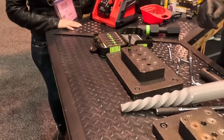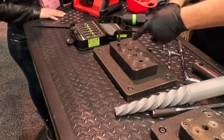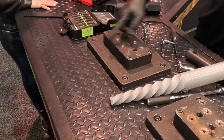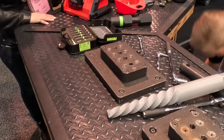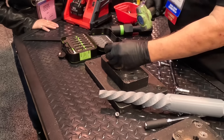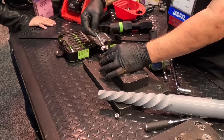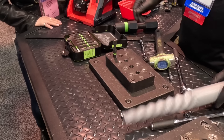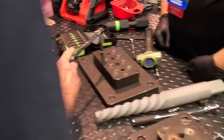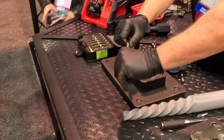The next function of that sleeve: if I'm in a situation where I want to heat the bolt and it's not going my way, I don't want to burn the tool up. If I continue to spin down on the sleeve, it becomes a puller and it'll pull out of the cavity. So now I can heat that metal up without bluing up and softening my tool. Because of the way that head's designed, I can put it back in the cavity and into the same grooves I made the first time. Now it's heated up — put torque on it and it bites down the second time just as well as it did the first time. There is not another extractor that can do that — unengage it, re-engage it, and have it bite like that.